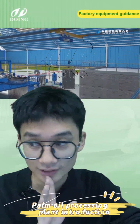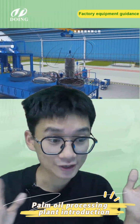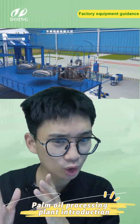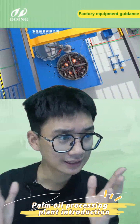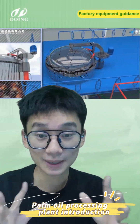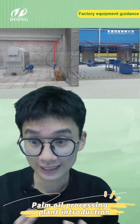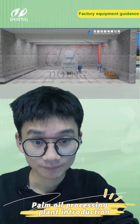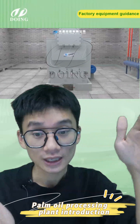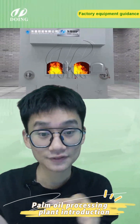This is our grading machine. Let me show you more clearly — check the size of the mesh, it is not the same. The left part has a smaller mesh size, so all of the small nuts will come out here. The main purpose of this equipment is to separate all nuts into two parts so that the next cracker can easily crack them. The big nuts cannot go through the left side, so they come out at the right part. Smaller nuts exit at the left and bigger nuts exit at the right.